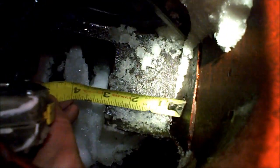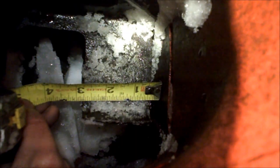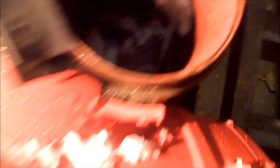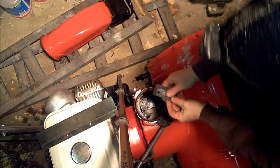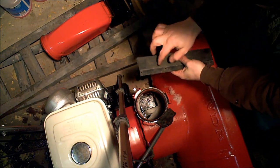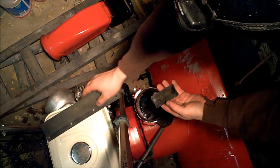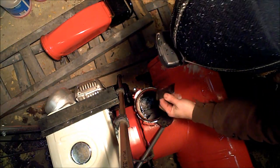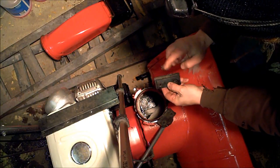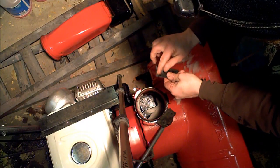I've cleaned this out pretty good so you guys can see. That's about a three-eighths of an inch gap between the blower housing and the impeller. So we take a piece of rubber — the length doesn't matter as much. You need two holes in it. I like this chamfered edge because it wears down faster. If you use a piece that doesn't have a chamfered edge, I actually chamfer it myself. I trimmed this one a little bit just so it fits in there good.